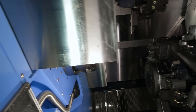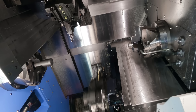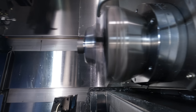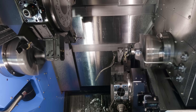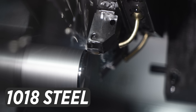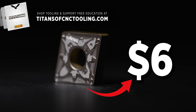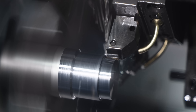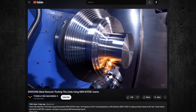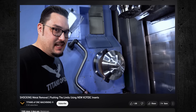First up, we're gonna rough the parts on both the left and the right spindle. We're using a CNMG 432 Kennametal new grade and chip breaker — it's really a good balance between toughness and wear resistance. Go check out Tyson's video where he breaks it down, shows you different depths of cut, and really shows you why it's such a great insert.